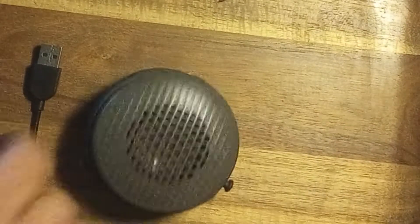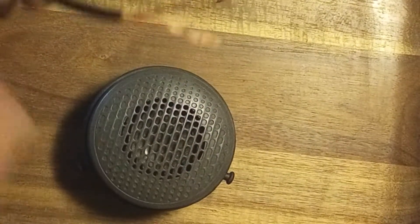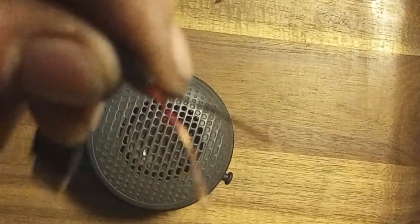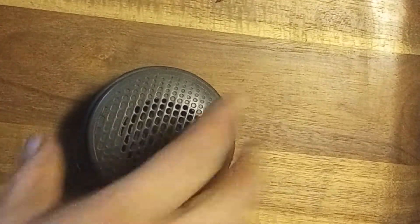How to fix a broken Bluetooth power port with a USB cable. You're going to want to cut off the small end — the micro USB — and strip down the red and black wire. You want about an inch of bare wire on each cable. If you have four wires, it's always the red and the black; usually white and green or gray are data wires — set those aside.